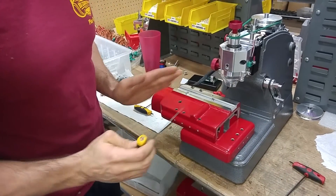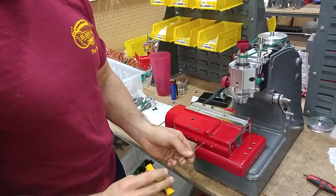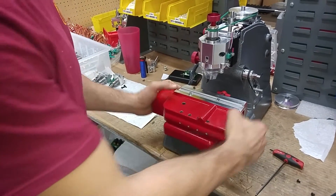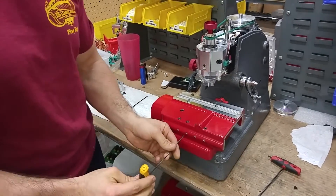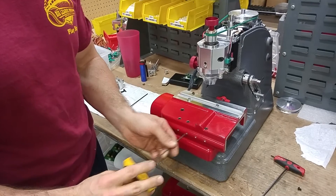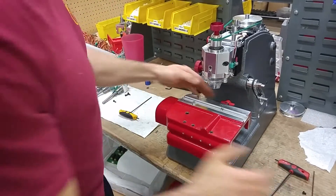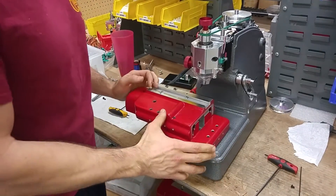Now we're going to come to this side, which allows the bearings to move over to this end. So now that we're over our bearings, same thing here — same amount of pressure, very lightly. Now we're going to come back and make sure there's no play in our table. Just shake your table a little bit — just the top table — make sure there's no play there, it's nice and tight. I'll double check myself and maybe put just a tad bit more onto it. Make sure our table is nice and taut. Adjust our bearings — same thing on this side, just a little bit. Now make sure you have full motion to where this is sticking out a little bit past your table. That means your bearings are grouped correctly.